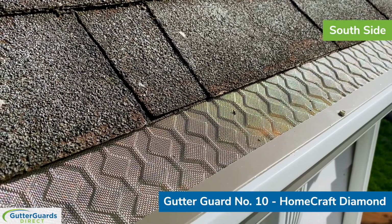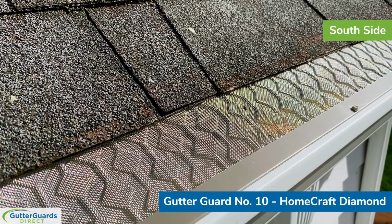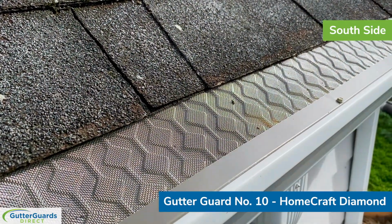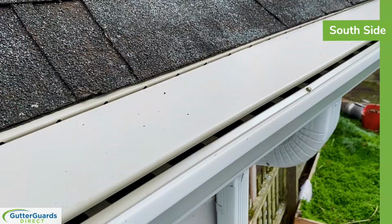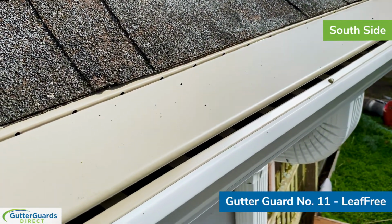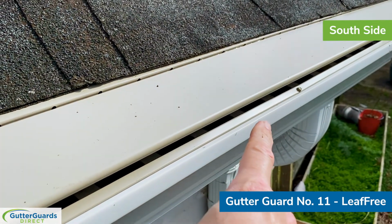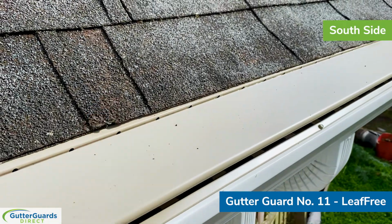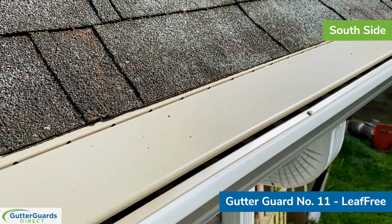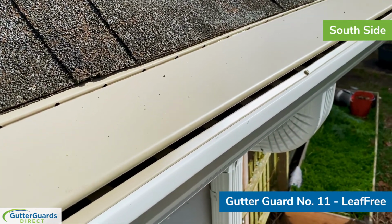So whatever may have rolled off the roof or washed off the roof last night has continued to come off the guard, other than a few granules here and there. This is LeafFree. It's a solid gutter cover. It's designed to screw down on the front lip, as you can see here, and then it has a panel that slides up underneath the first course of shingles. It can work with both 5 and 6 inch gutters with no problem.